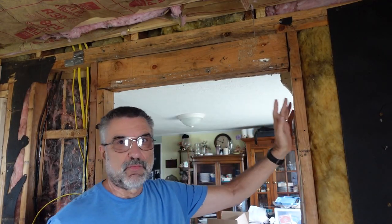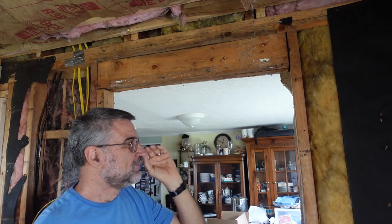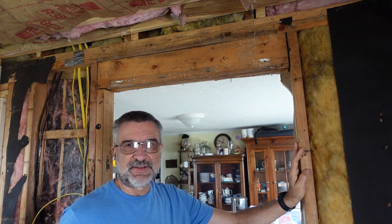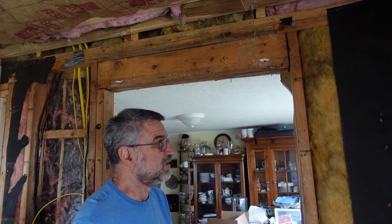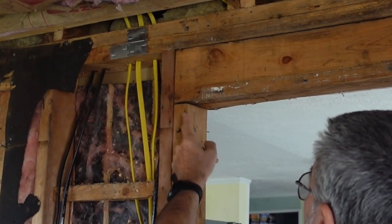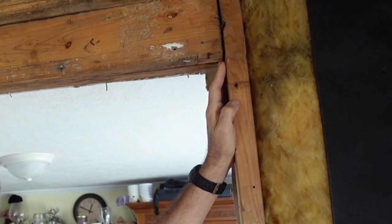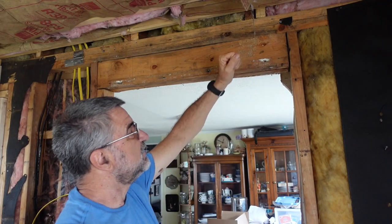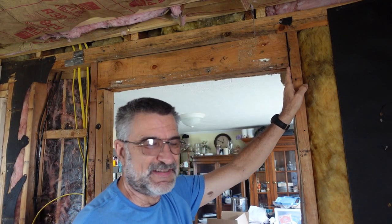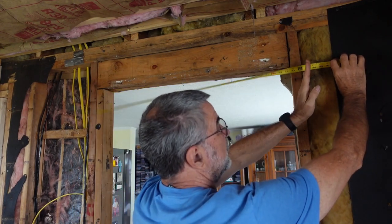So this is actually a bearing wall. This used to be the outside wall of the house that holds up the roof. I need at least 36 inches. Right now I've got 34 and a half, and I would think, well, that's almost close enough, but it really isn't, because see how over here there's a jack that holds up this header? The jack here has been removed. When we got our new refrigerator, it wouldn't fit through, and I had to take out that jack to get it through. So now this header doesn't have any support underneath of it, and that's not a good situation. So I'm going to have to come over here 36 inches and then put a jack